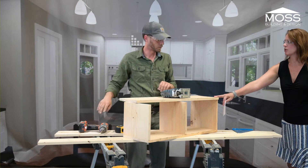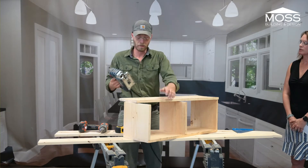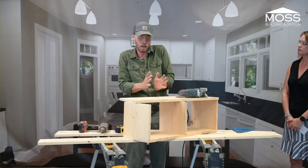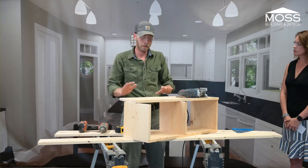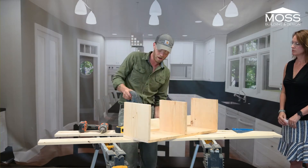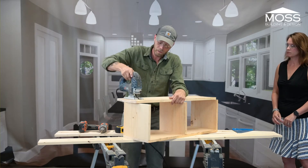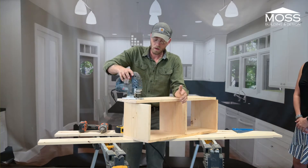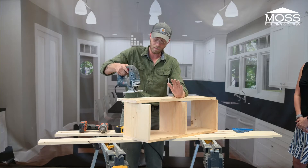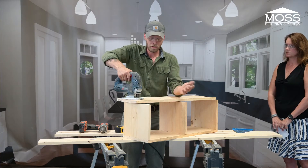It's easier having the board raised so it's closer to use. In any cut, you've got to understand where the blade is on the other side of the piece. With a circular saw cutting across the grain, the board is going to fall into the cut, so I like to move it off and have the cut fall away. In this case the blade is going down underneath, so we're not going to have our hand under there. I just slip it on down in there and we're ready to roll.